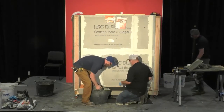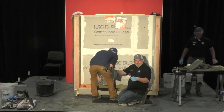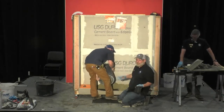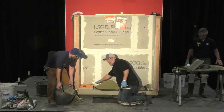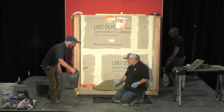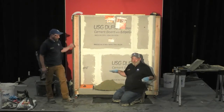Dump that out along that wall there. In the same way that he set those screeds, those sticks that he used to pull off those two points, we have two fixed points here, so this is going to be really easy. We've got a drain that we can pull off of, and we've got our floor height that we can pull off of. But in a real world situation, we would have to get elevation points off of this height around the perimeter. We want it to be nice and level around the perimeter.